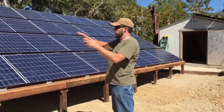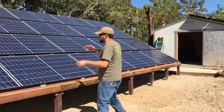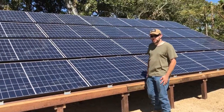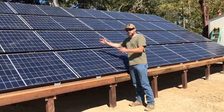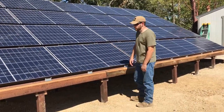We're actually trying to transition to these for future installs, because the space that had been taken up by the 270 watt modules we use — we can actually fit that extra 20 watts now in that same area. So that's the reason we're trying to transition.